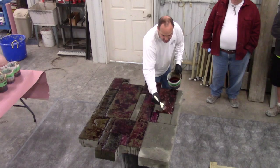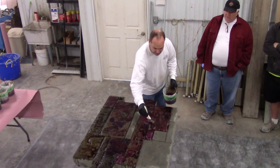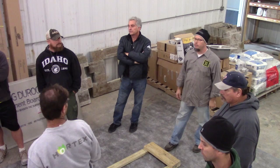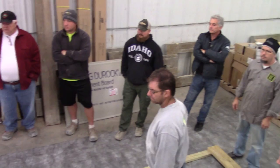It's totally easier to stain these while they're laying down. You could never get some of these color anomalies if we had to stain this upright and spray it. That being said, you certainly could spray them afterwards and you'd just get color that runs beautiful. A lot of people stain that way — big wafts of different colors. But doing it this way is more precise; it'll look more like stone that was set in place.